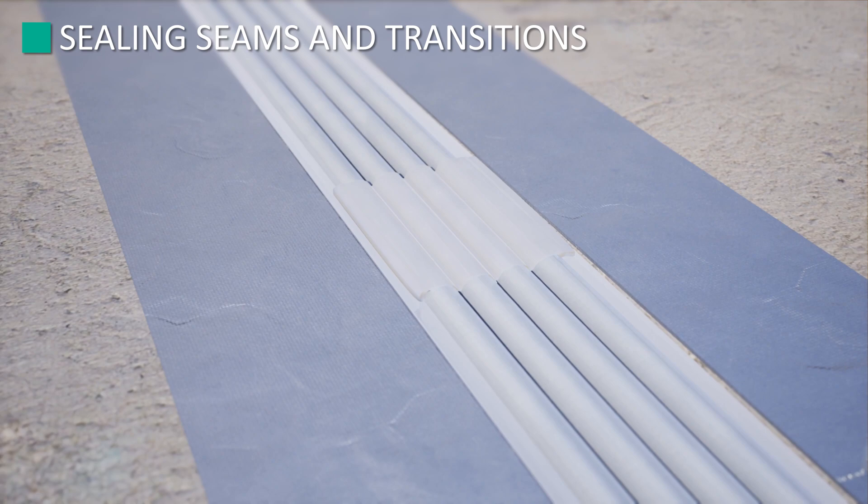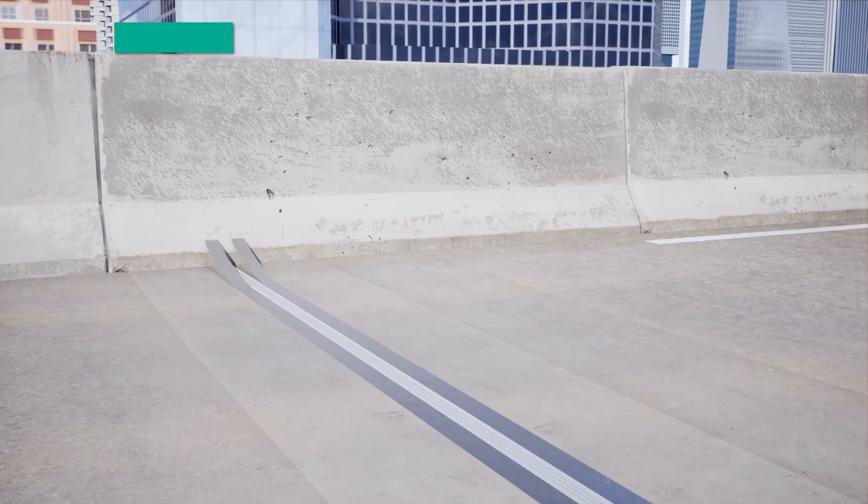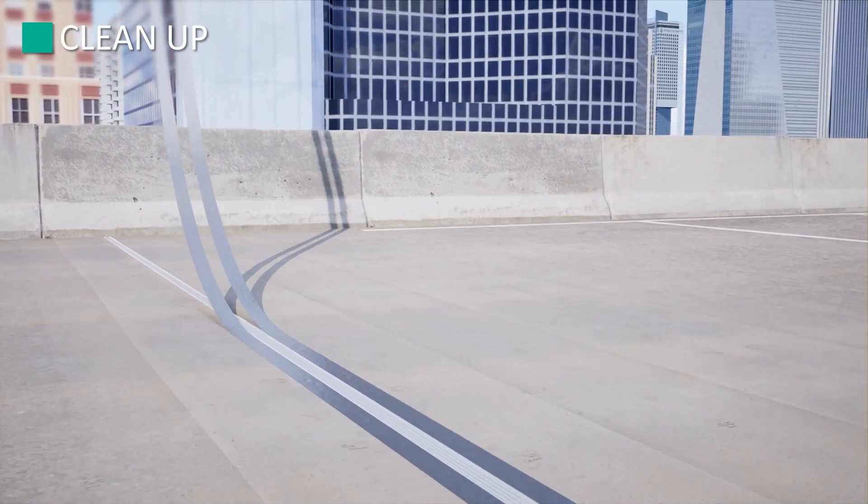Note: it's important to check that the bellows line up at the butt joints and that the butt joint sealant and seam sealant has not glued the bellows together. This is important so the bellows expand and contract independently, which is necessary for the joint to function properly. Be sure to remove any excess adhesive material left on the surface of the substrate. Do not allow the excess adhesives to cure. Finally, remove masking tape from the sides of the joint.